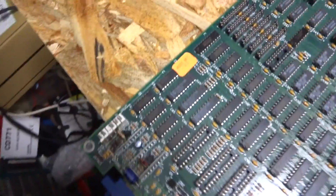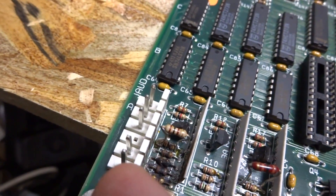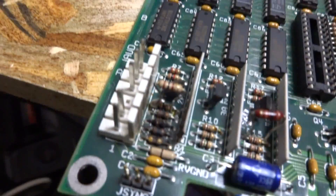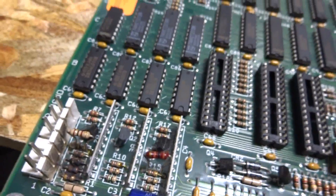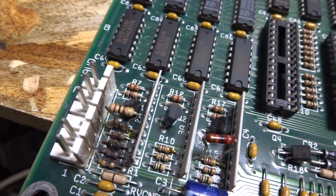Let's take a closer look at the board. As you can see, there's one light on here — that's the only one. There's actually a green light and a red light up here but those aren't on. Now let's turn this off. You can see over in this corner there was a nice little fire with some capacitors. What I'm guessing is somebody tried to plug in this connector — it looks like maybe it's in the audio area, maybe part of the video connection as well — and there are some traces that have seared all of these resistors.